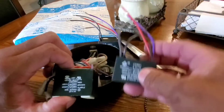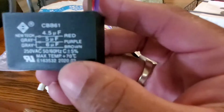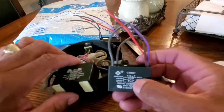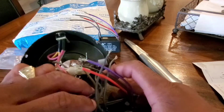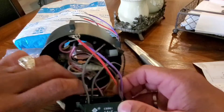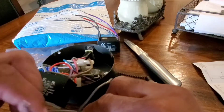Let's make sure that these capacitors are the same. Now, you have three different wires here — you have brown, red, and purple — and this is how you can tell which ones you need. Got the red, the gray, purple, and brown. And this new one here, it looks like it has the same thing: red, brown, purple. So we're good. Basically, whatever wires are connected, we just have to rewire them onto the new one. Hopefully that'll fix the problem — if not, I'm really going to be kind of annoyed — but let's go ahead and see if that'll work.